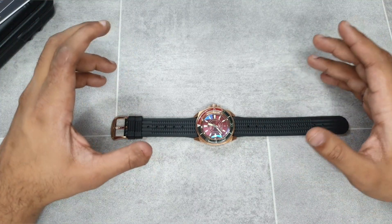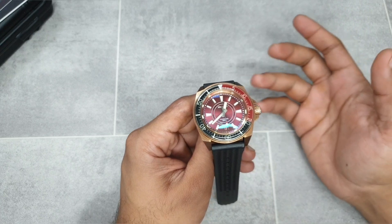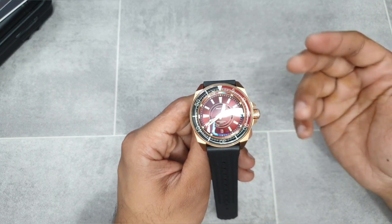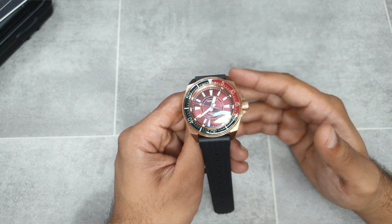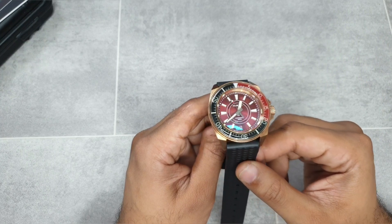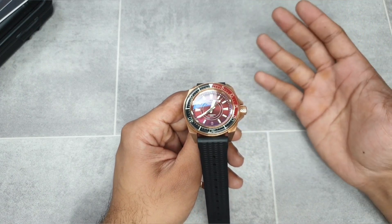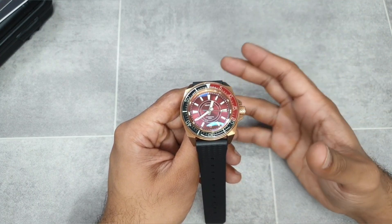Let's talk about the specifications. This watch has an NH36 movement, which is the same as the NH35 — the Seiko Epson 24-jewel movement which hand-winds and hacks. It beats at 21,600 vibrations per hour, which translates to a sweep of six ticks per second. It's a very robust and reliable movement — yes, people call it boring because it's used in so many watches, but it is super reliable.